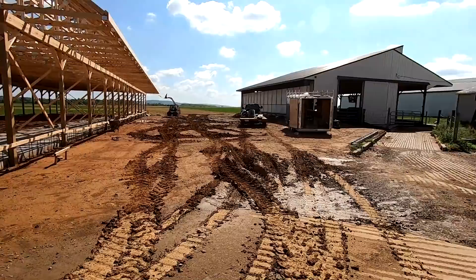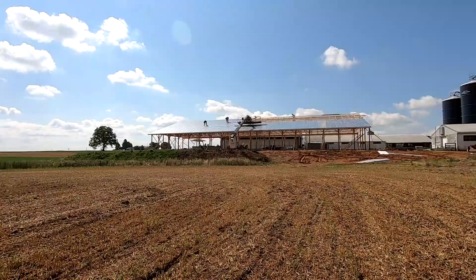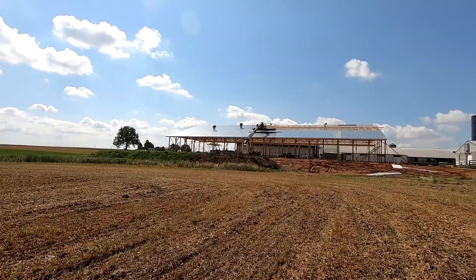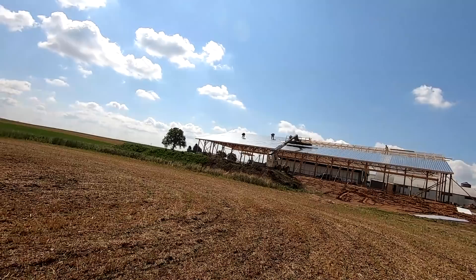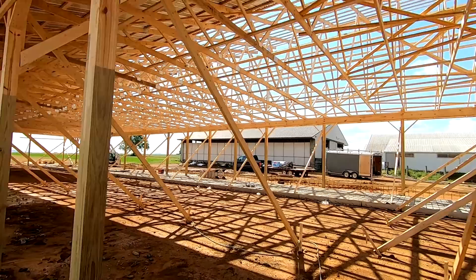We got almost two and a half inches of rain since yesterday afternoon. They're getting the roof put on now. Yesterday they put all those trusses on, got all the purlins laid across — that's the two-by-fours going lengthwise — then they just attached the metal onto it. We're putting a steel roof on this building. A lot of our barns have aluminum. The advantage of aluminum is it doesn't rust, but it'll move a little when it heats and cools and can work holes in it and start to leak. So we decided to go steel on this building.